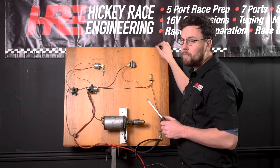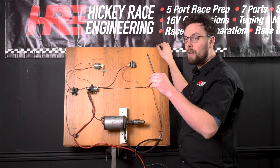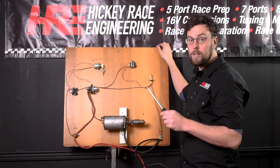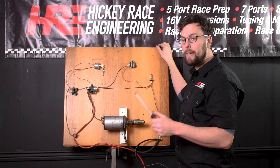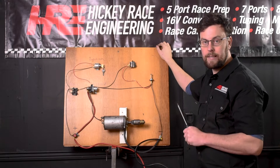There's a system you need to follow when you're electrical fault finding, and it has a number of steps. The very first step is looking at the battery and checking its health first. So let's go over to the battery now and have a look.